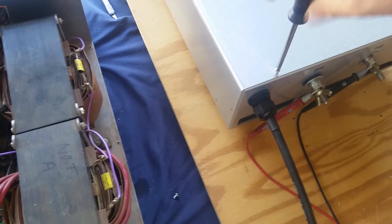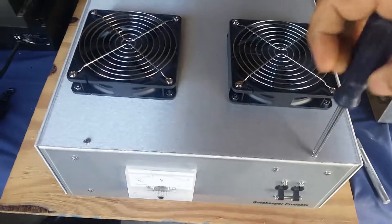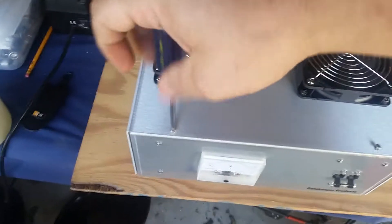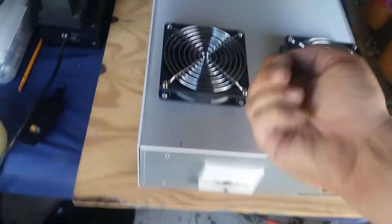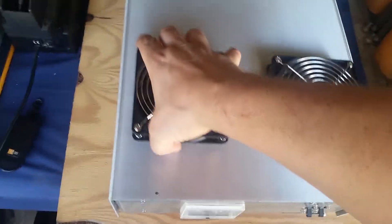It's a very, very clean supply — I think it came out great. I was not going to use a bus system to begin with; I was just going to take the DC output wires from the modules and bus them all together and deal with the extra length through toroids. But I quickly saw the amount of room I had in this thing wasn't much, so it would be a lot more efficient to use a bus system with a copper board.